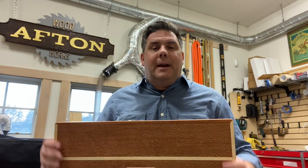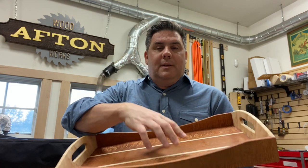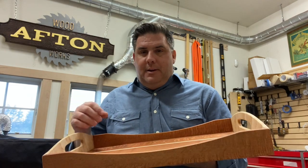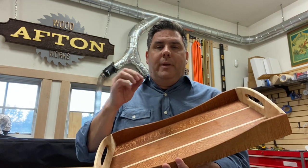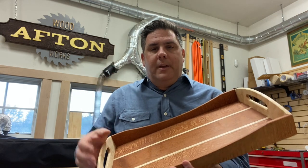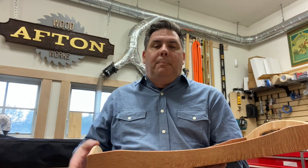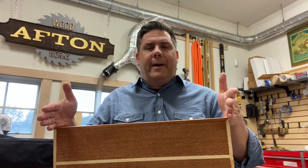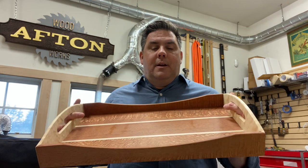As I was putting it together I thought, man, I really don't have any solid or proper connection between this base and the sides. I didn't do a rabbet or anything like that. So what I did is I actually cut a dado all the way around the base the width of the kerf of the saw blade, and then I cut that same kerf into all the sides, and then I took a piece of pine and cut splines. There's a spline — it doesn't go all the way end to end but it goes through the majority of the sides to really bring it together and lock it. Kind of like a biscuit joint or a domino, and I think that really helped.